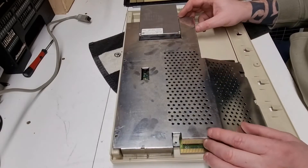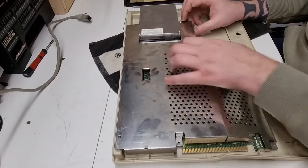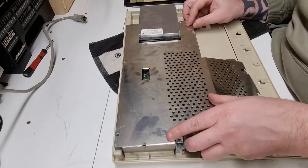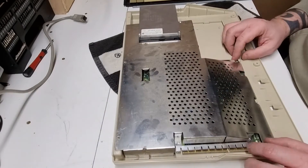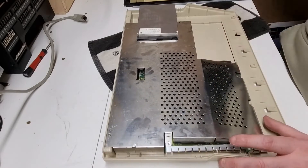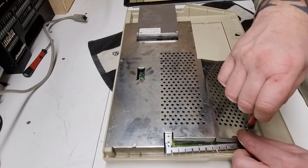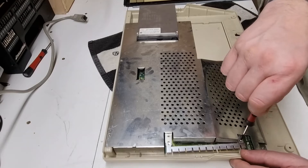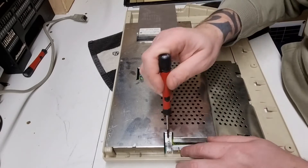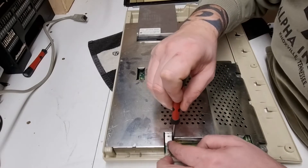I'm going to give it a proper clean up later on — that'll be another video, along with some modifications. Always back screws out until you feel it click, then if you're going into plastic — metal screw into plastic — back out until you feel it click, which means it's at the top of the thread. Then you can screw it in, which means you're not recreating a thread in plastic and making the plastic weaker.